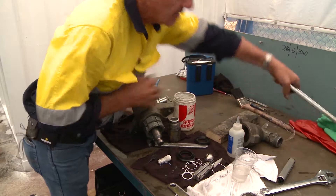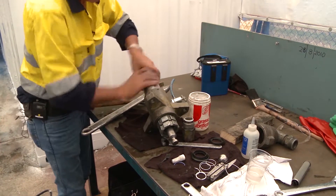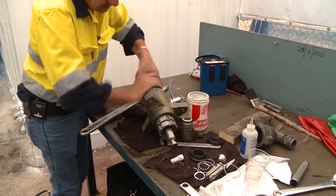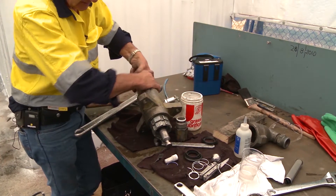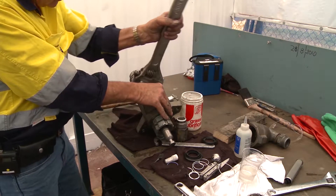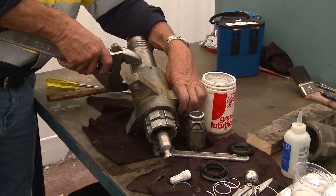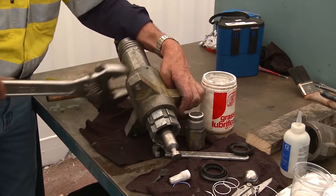Now that I've started this back into the body, I can do it up by hand until I reach the nylon o-ring. Once I reach the nylon o-ring it's hitting the taper on the seat and I'll need a little extra torque to squash it into the taper. This is a coarse thread so it'll take quite a bit more to wind it into place. I'm just torquing this into place by squashing that o-ring into the seat — not excessive force — and there it is, back in the seat.